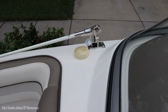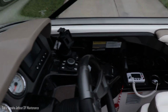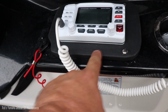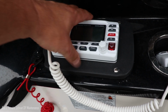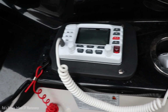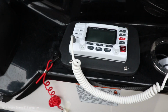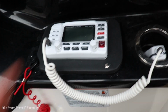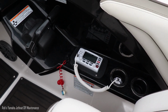All right. So we got the antenna installed. It's folded down right out of the way when we're not using it. We got the head unit installed. As you can see, we used black starboard, cut it. We just replaced the whole cubby hole thing there. Now, this is not in tight yet. We're going to take it out this weekend to make sure we get good distance from all the connections and the antenna. He still has not figured out a permanent place to mount that yet for now. So we're all done except for after the trial. We're going to mount this down with some silicone and make it permanent. And that's it. It took about 2 hours. We're good.